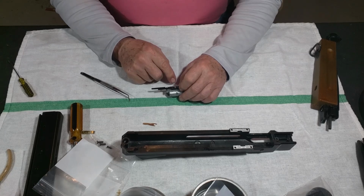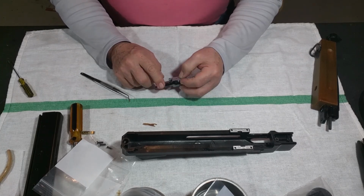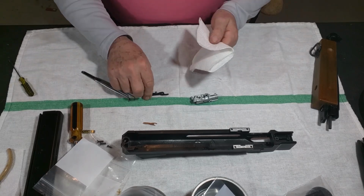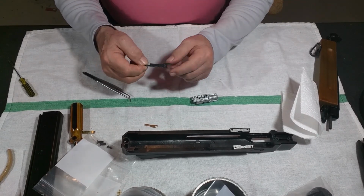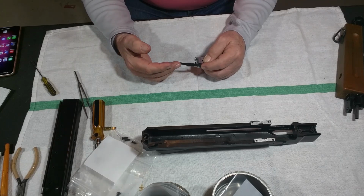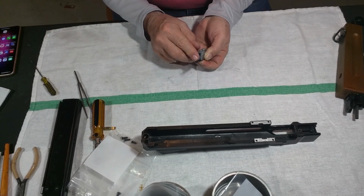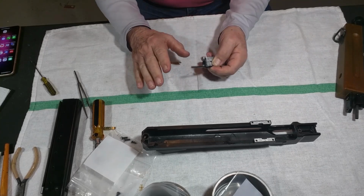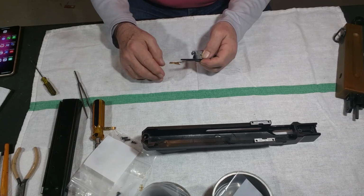As you can see, there's that little device that, when that arm comes up, it pushes this up, which is really down. And that's what enables that spring, because there's the spring. Okay, this is the sear. It's just fine. Now, one of the tests you have is making sure this is flat and straight. It must be straight, because if it bends in just a little bit, it's going to really exaggerate that angle, and it will miss the bolt catch that this has to catch on right here. That's the bolt catch. So when it goes down, it catches on that bolt. You want that thing to be away from the bolt when it's up and catching when it's down. If it bends in, this will dig into the white metal that's on the bolt and catch it up. So that's how you adjust the sear.